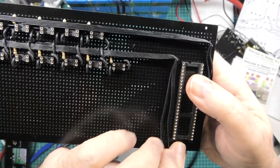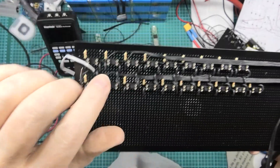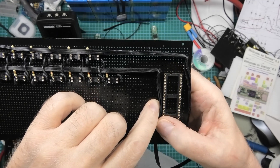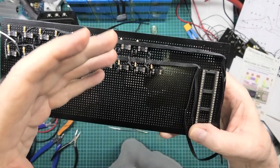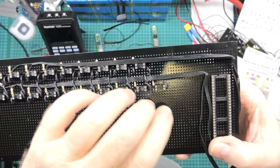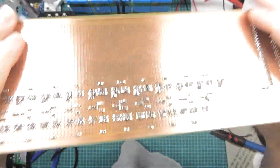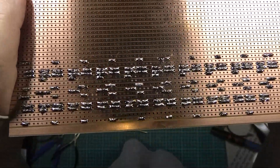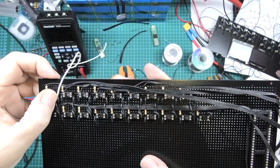I've got to wire the Teensy up now to all the ports, then wire the battery leads up. This is only a prototype test — it will do about 12S purely because of the limitations on the ports. On a future version I'll use something like shift registers or multiplexers, I don't know yet, but that's the way it's going to work. It's near enough done actually. I've still got to cut all the tracks — I don't cut the tracks until last, I've learnt my lesson, just in case you need to shift anything across.